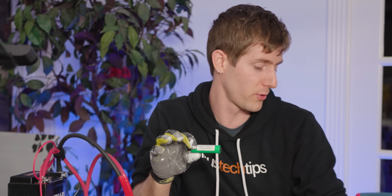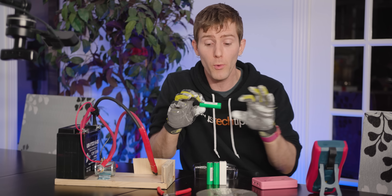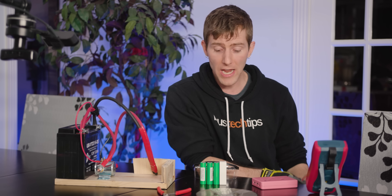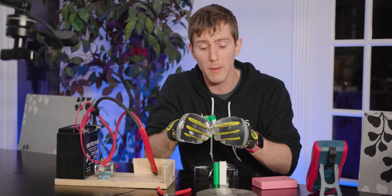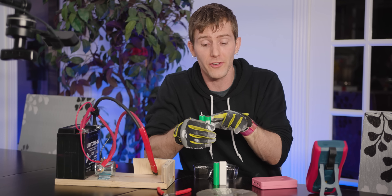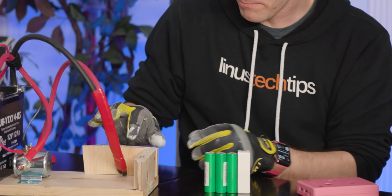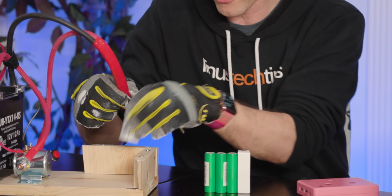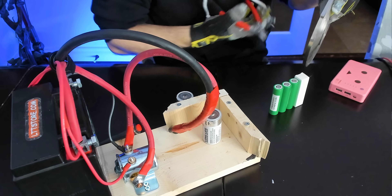These are actually the same ones that I used for my DIY souped-up Power Wheels battery a little while back. Fortunately, they've been sitting in storage at around 3.62 volts, which is well within the safe storage voltage for these. And this is another really critical thing — I have checked all of these 18650 cells with my multimeter to ensure that they are all the same voltage, because you can run into some real trouble when you start spot welding together batteries that are at a different storage voltage. All of a sudden they're going to equalize nearly instantly and they can get super hot, which can be very dangerous. I've also got a couple of dead D-sized cells that I'm going to be using to practice my spot welding, since unlike Colin, I haven't taken a run at this yet.